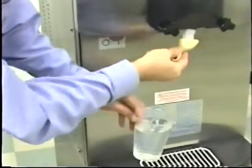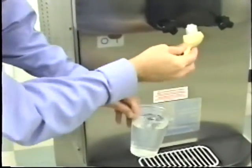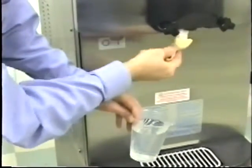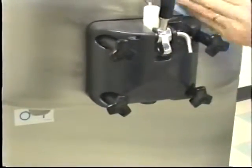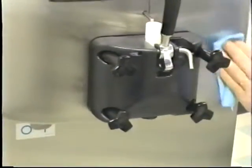To assure sanitary conditions are maintained, brush clean each item for a total of 60 seconds, repeatedly dipping the brush in sanitizing solution. Using a clean sanitized towel, wipe the freezer door, the front panel, the area around the bottom of the freezer door, and any other areas that demonstrate a buildup of either moisture or food substance.